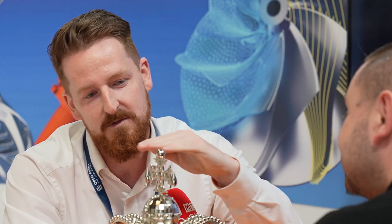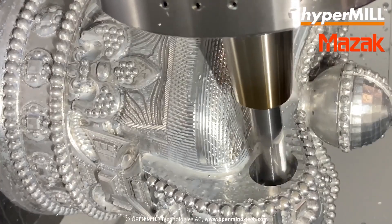Machining from top to bottom you must have faced quite a lot of challenges — take this side, there's nothing really holding that on. How did you get a nice finish? Because to me that would have just been a vibrated mess. The individual areas are about one mil in thickness and we're 50–60 mil up, so if you conventionally just rough it all out to 0.3 and finish it, it would have just flexed backwards and forwards. So what we did is we did it in stages — 10 mil rough, finish, 10 mil rough, finish — and in HyperMill we have smooth overlap, which blends the toolpaths into each other so you wouldn't see where one section ends and the next begins. This has been done with multiple tools, but you can't see where one tool finished and the next started.